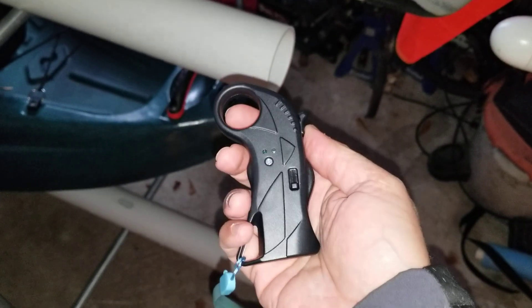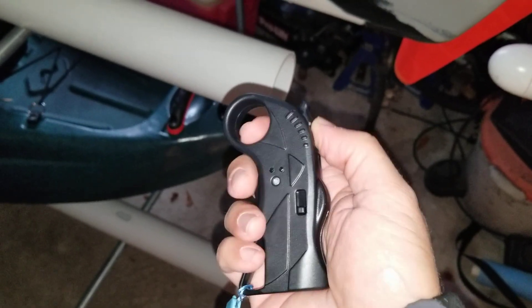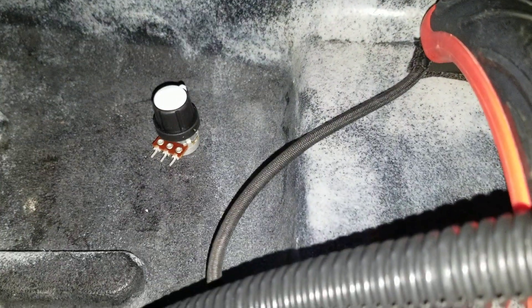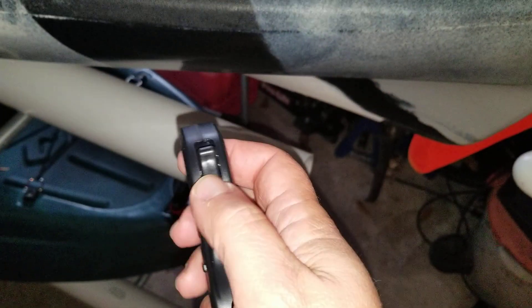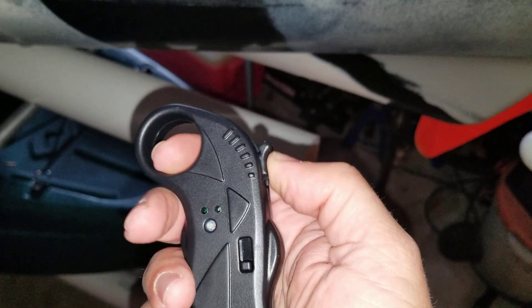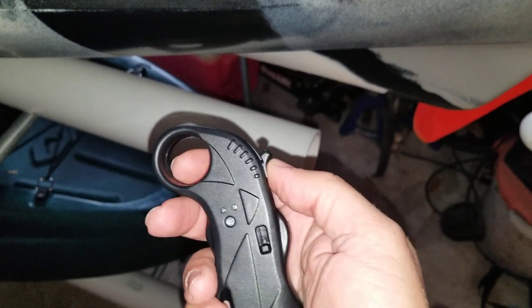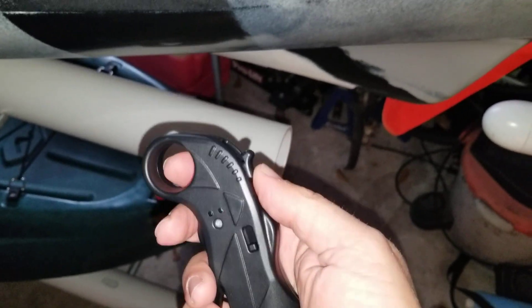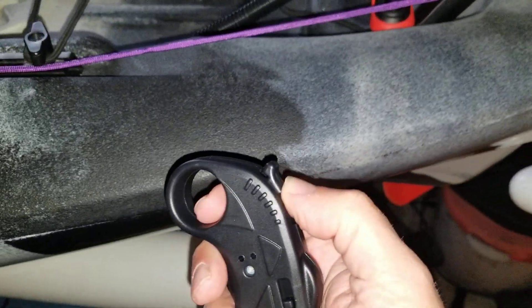If you want to make a long run you have to hold it; if you're trying to troll you have to hold it and you don't have hands free for anything else. I wanted a regular potentiometer — a regular pot switch. I thought I'd just hack it open and install one, so I got a little pot. But when I opened it up, that spring-loaded mechanism is not a slider pot — it's a hall effect sensor, and that hall effect is baked into the PCB inside. There's no undoing that, no adding a dial pot to this controller.